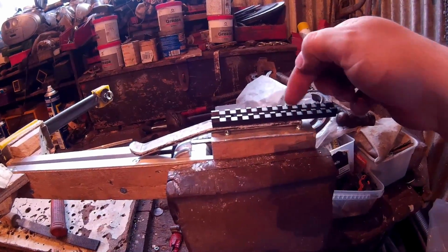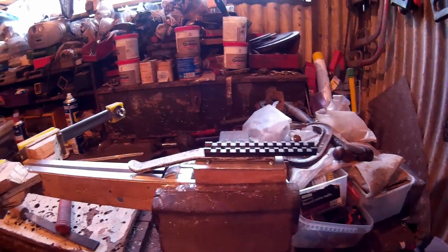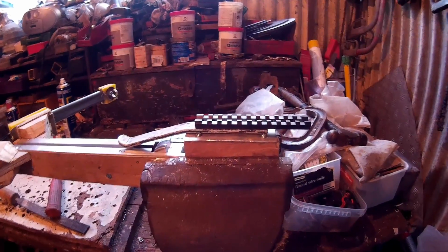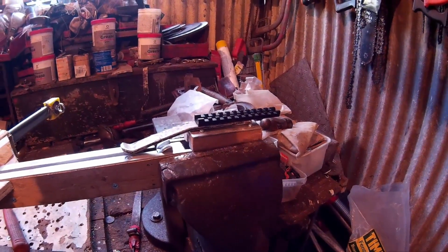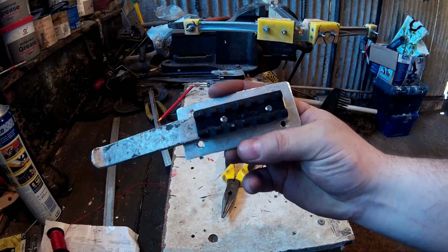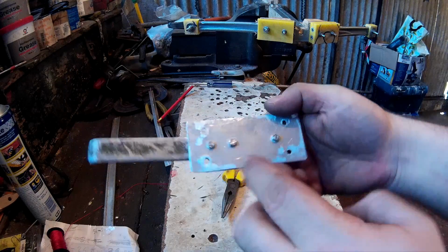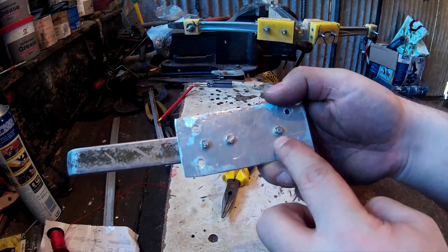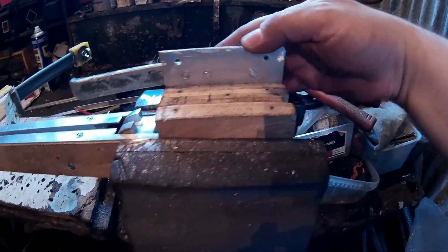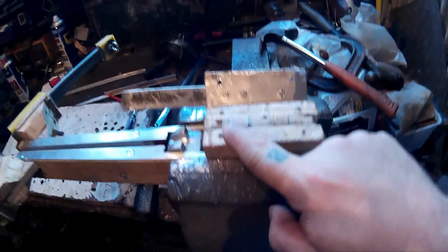The weaver rail needs to be cut, and all those 3 pieces need to be bolted together. And the little face plate at the bottom has 4 holes in it, which you'll see in a minute. So there's the weaver rail on, there's the bolt holder and the little face plate. There's 3 little bolts holding those 2 parts on to the plate. And then you'll just need to countersink some holes underneath to take the heads of the bolts, otherwise it won't sit flush.